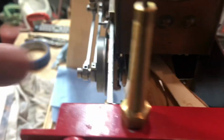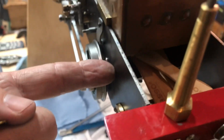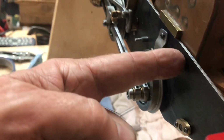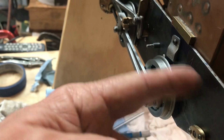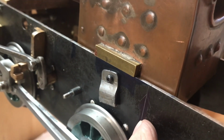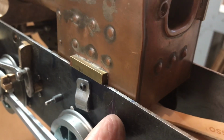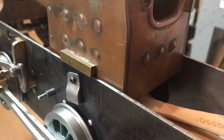Okay, for putting the rod or whatever it is across the support for the ash pan, they give you the length in, that's 3 3/8 inch from the back. That was easy enough to mark here. The critical thing is how deep, so that the rod supports the grate and keeps the ash pan in place, but is not so deep that it blocks the flow.